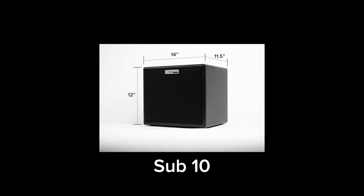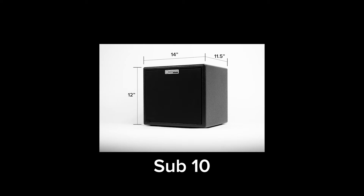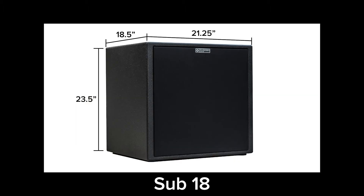Use your ears and listen to where the subs are placed. Subwoofer Pros offers three choices: a Sub 10, a Sub 12, and a Sub 18—all are very small. The Sub 10 is perfectly appropriate for six-inch two-ways. The Sub 12 is great for slightly larger speakers that need a bit more output. The Sub 18 is suitable for any size monitor. You can also use these in multiples to get more output—just like in live sound, when you double the number of speakers, you gain output.